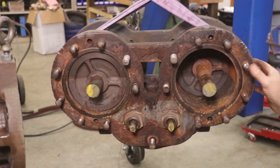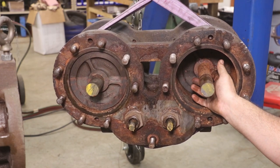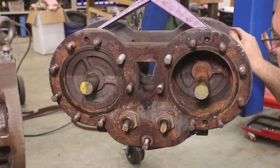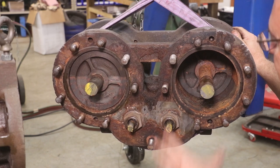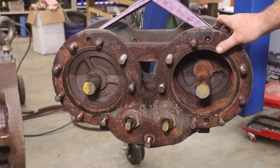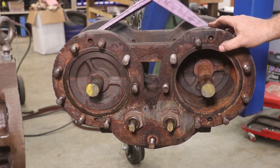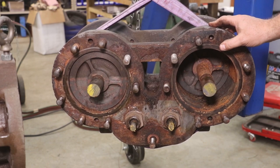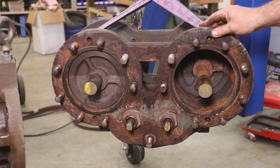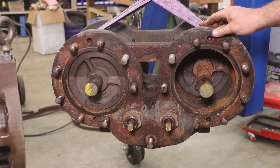When I started looking at the blueprints on these cylinder rods, what I discovered is there's actually a taper on the backside that goes into the bottom of the piston and then it's tightened up on that taper. So these are actually wedged into a taper — just like a Morse taper on a lathe. Once it gets seated, it's a really tight fit, so it wasn't just going to pull apart real easily. I might have been able to knock them out with a hammer, but I also might have busted the pistons in the process. So just cutting the cylinder rods was the answer. When I picked this up from the folks up in Nashville, they told me I was going to have to cut the cylinder rods — and it was no big deal because we're going to have to make them anyway. So no harm done.